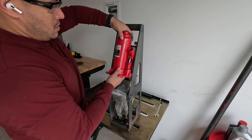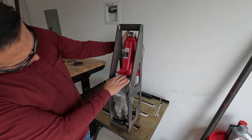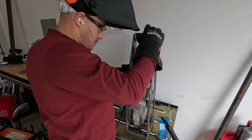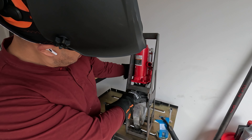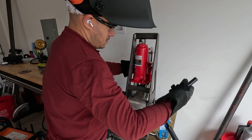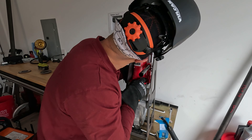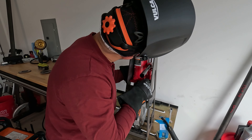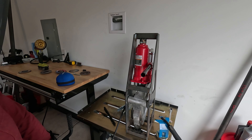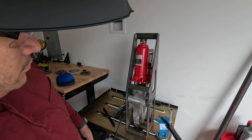The upper support bar is welded on at an angle and it's not as wide as the jack retaining cap, so when I welded on the jack retaining cap, that's also going to be naturally at an angle. I had it flush with the front of the upper support. Honestly, I made this way too hard — I should have just laid the bender on its back, centered the jack inside it, took measurements of where the retaining cap should go, then clamped it down and tacked it. The jack is just too heavy to hold up and keep in one location while welding, so I ended up messing up the first tacks.